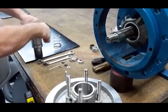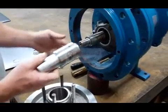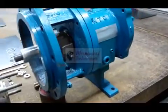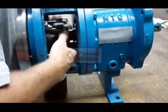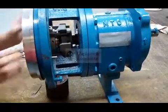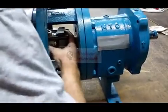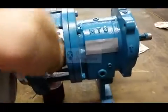You want to make sure you push it all the way to the front of the sleeve so you don't get lost trying to back it in and run out of space. Push that sleeve all the way back. I like to run my hand behind me here — push it right up, meet in your stuffing box.